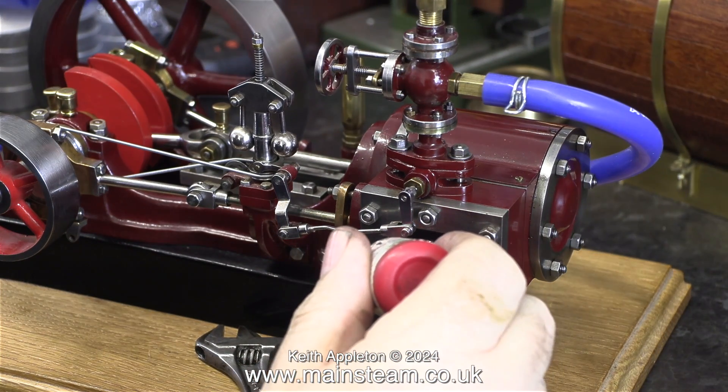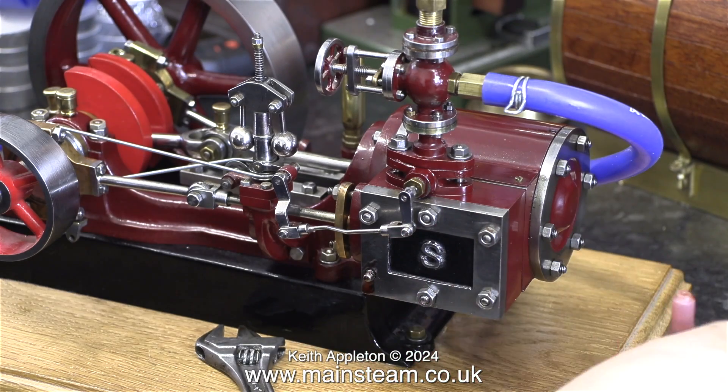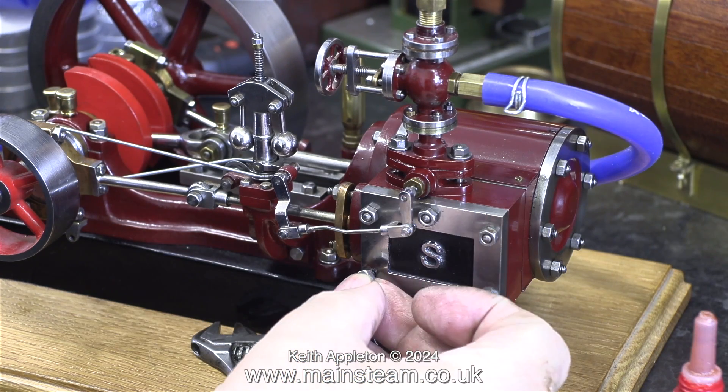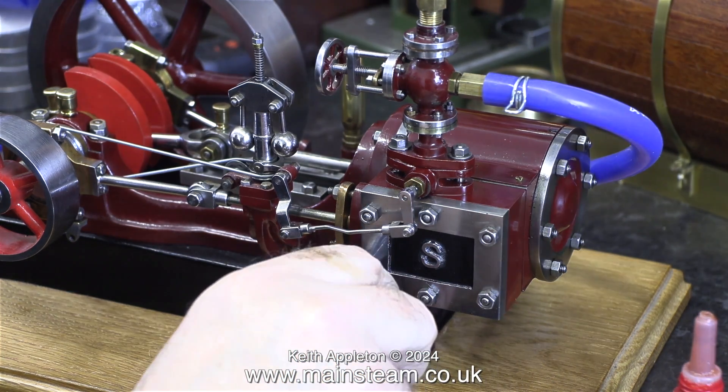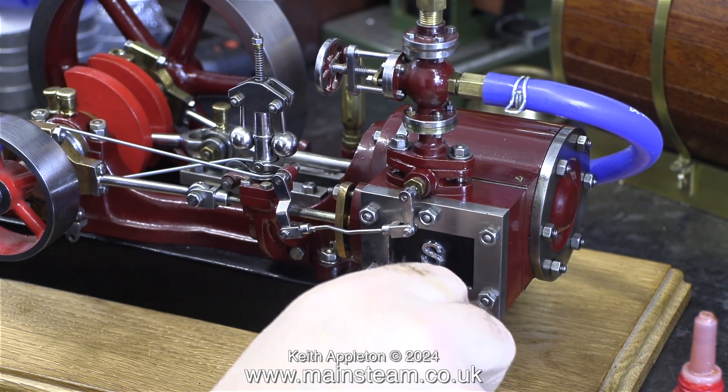As you can clearly see, the engine does run rather well. The oil coming out of the cylinder is clear, but the oil coming out of the bearings on the crankshaft — particularly the big end bearings — is quite black, so the engine is far from run in.